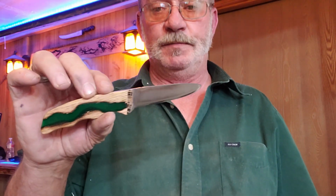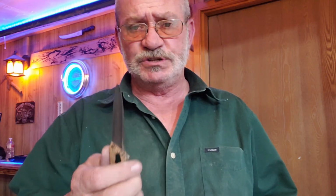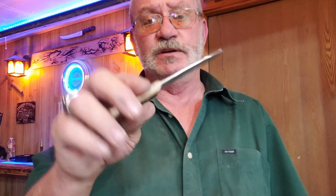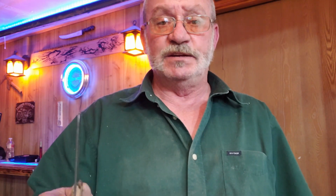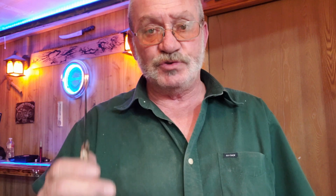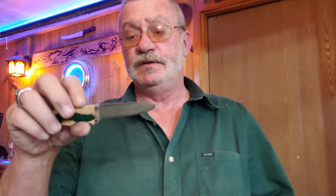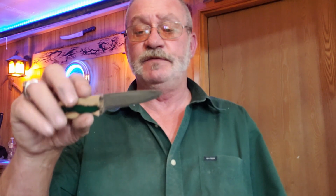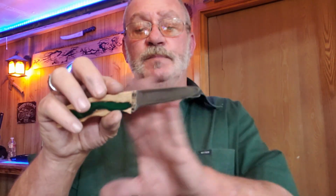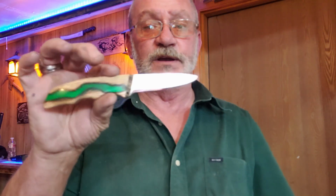I don't know if you knew or not how we came up with this, but I wanted the knife to be stainless steel because she's gonna be using it, throwing it in the sink, what have you. So we wanted it to be a stainless steel blade. And you can forge stainless steel. The problem with stainless steel is it's a whole big can of worms to heat treat, harden it, and temper it. So what we did with this is we just took an old store-bought butcher knife, and we cut it off right in front of the handle and drew out our pattern for our paring knife on the butcher knife blade. Then we just did stock removal and cut it out of that. So we know we've got a good hardened steel blade.